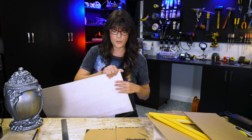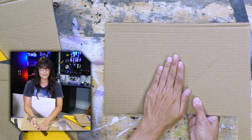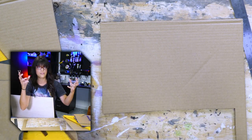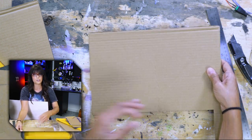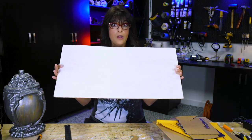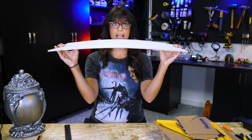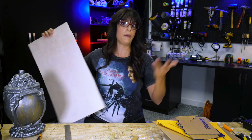Copper strips are also much easier to solder wire to. Although if you don't want to solder, this project is totally doable without soldering. If you are making a larger foot switch and someone steps on it, you have a big hollow middle, so it'll start to crease over time and your two middles will stay touching - causing your prop to look like it's possessed. Cardboard is great for a night of fun, but definitely not durable for a full season. My go-to is always the quarter inch plywood because it's super cheap. You can buy them in large sheets, cut them down to size, and it's flexible enough to flex when stepped on but rigid enough to bounce back into place.